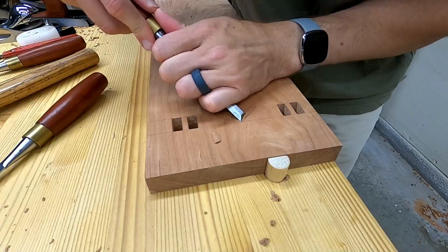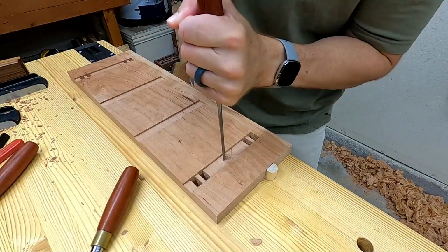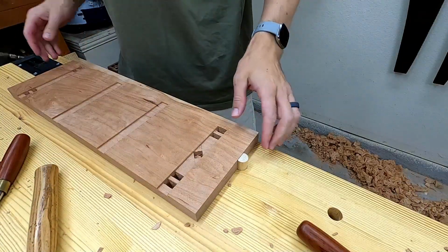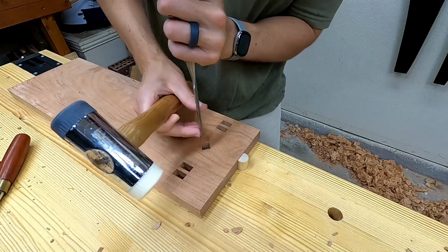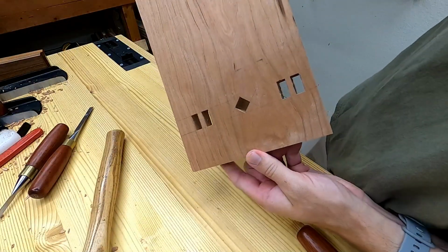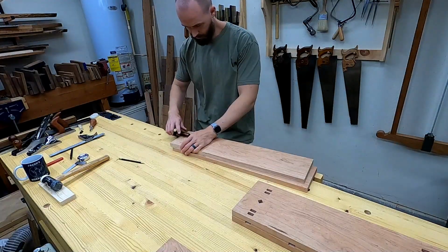And I gotta admit, it was about right here where I thought, hey, I'll just leave this little recess and just trim up a little faux tenon to sit in that diamond. But I figured, hey, if I'm gonna do it, going balls to the wall. The initial idea was for the tenons to protrude by 1/8 of an inch, so I set my gauge to the thickness of the side piece, which I changed my mind later for 2 reasons you'll see in a little bit.